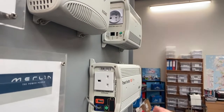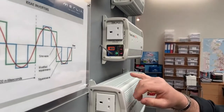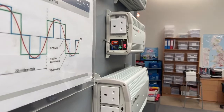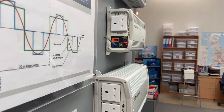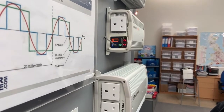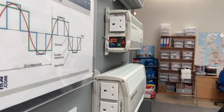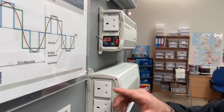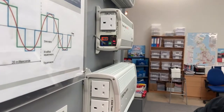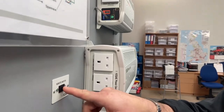Getting to the larger product, the 1,000 watt unit — when I switch it on, it has a display on the front which will show you the battery voltage and how much power you're pulling from the inverter. It's got a small USB output. In the event of one of the multiple protection features being activated, it will give you an alarm code so that you can look in the manual and see what that alarm code means. There's also a small remote switch available which allows you to switch the unit on and off remotely.